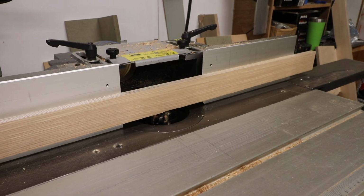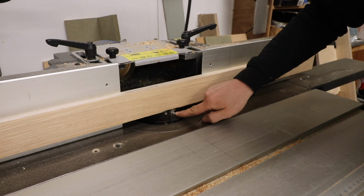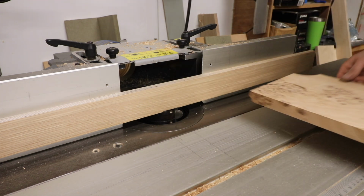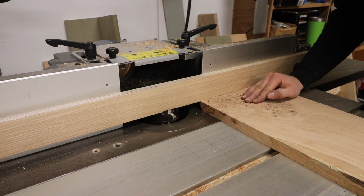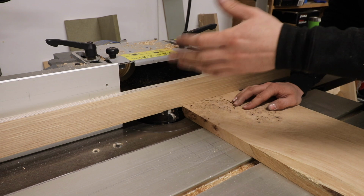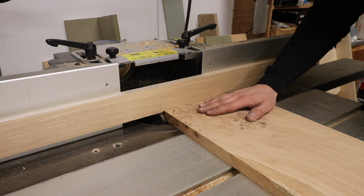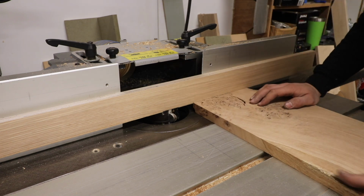So the machining action that I was using, like you would do on a Spindle Moulder, the cutter is, as you look at it here, on the left, and the block will spin in this direction. That means traditionally you feed the timber in against the action of the cutter block, and that's the safest way to machine something. As you machine the timber, it clears the material behind the cutter, and if anything happens and it slightly kicks, that's the worst reaction you get. It doesn't then further accelerate the piece of timber. That's a proper cut and how you're meant to use the machine.